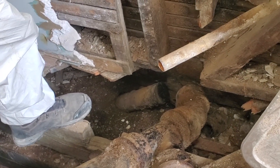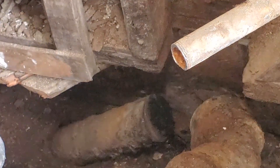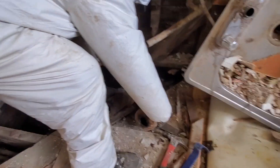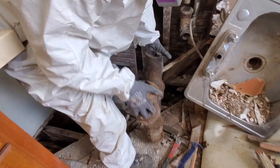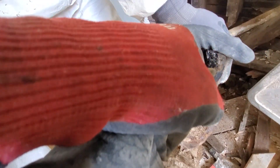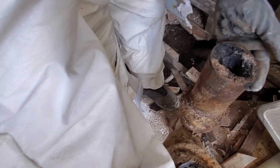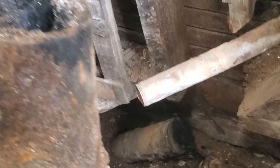There's the stack — that's the pipe that ties into the sewer right there. Look at that. There's nothing but buildup in there. This side's not bad, but look at that — that's the vent right here — but this is the stack right here. It's like a penny — you could fit a penny in there. And it's going to be like that all the way to the sewer for sure.